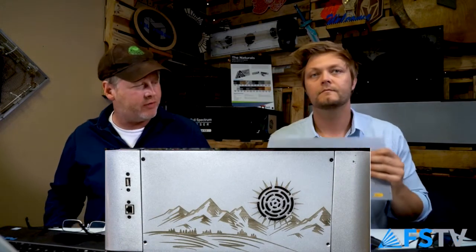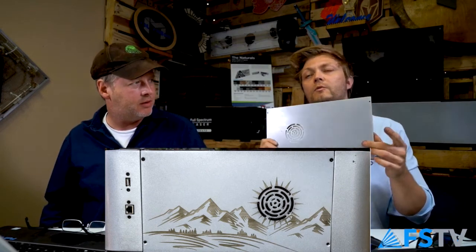That came out great. So what are you actually laser cutting off of the side panel? So we're removing the silver paint and then exposing the bare metal underneath. There was just a little bit of post-process cleanup because that paint heats up and the vapors get on there. And then we just washed it away. I used a little bit of water, and then for the tougher stuff, I used isopropyl alcohol. Came out really nice. Yeah, I like that panel. And then we did Laser Talk on Wednesday, and that was all about engravings too. All engraving. So this week was all engravings.